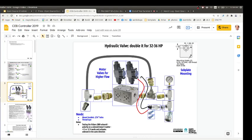We like to use quick couplers. This is a module that you build in the parallel build process: one team builds this, and then we put it on the machine and connect the hose from the power cube. It's all disconnectable, so we can take it away. But this can live outside; nothing is sensitive, and all these components are waterproof. That's one thing I didn't know that I think was really important about the quick disconnects. Yeah, the idea that they're able to isolate sections of the system while retaining pressure.